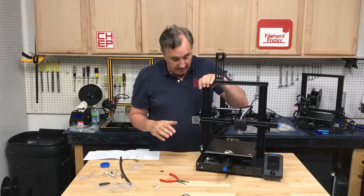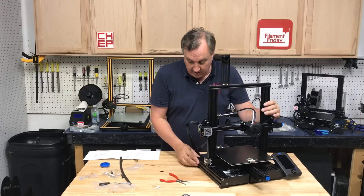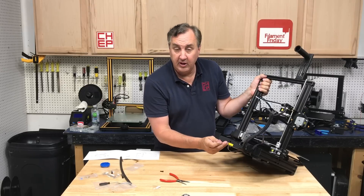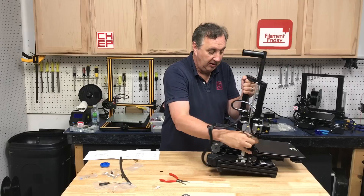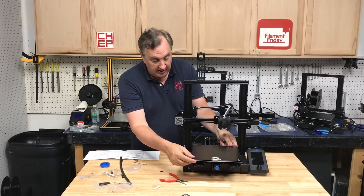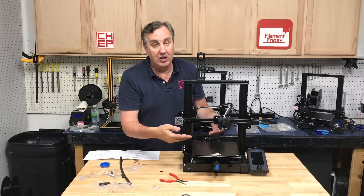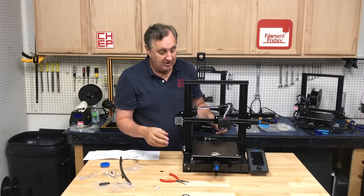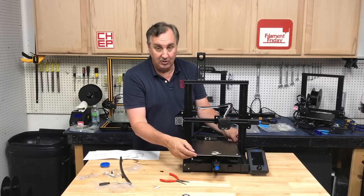I connected most of the connections — the only one left was the Z connection. I also had to switch the voltage selector from 230V to 110V since I'm in the US, otherwise it won't work properly. I also noticed how loose the bed was — there are eccentric spacers underneath to tighten it up. I probably should have done it before fully assembling, but I can get in there with a wrench and tighten it so the bed isn't loose.